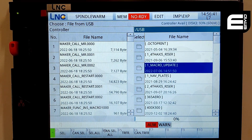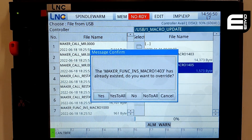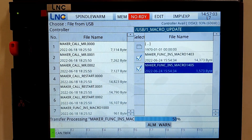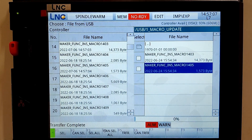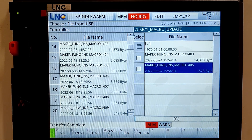Select all, and then transfer. The Maker Macro will override because we already have macros 1403 and 1405 in your screen set, but if you do yes to all and input, it will copy them across. Once that's ready, it will tell you transfer complete. Now you should be free from PLC freezes.